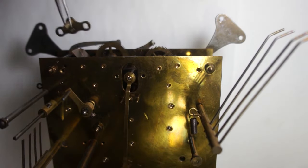So if I want to use these same fasteners, I'll have to plug those holes to make them a little snugger and then put those back in. Normally what I've seen is on these plates like this, where they have really short fasteners like this, they'll run the fasteners long enough to come through this other side and then peen them over. But they didn't do that on this one. And also the wood has shrunk in here and it's pulled itself away.